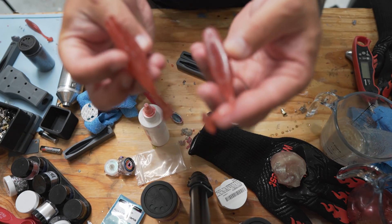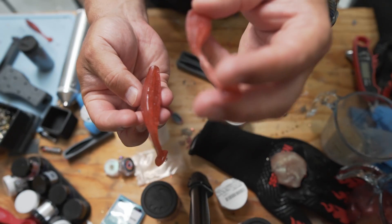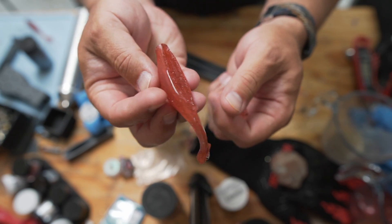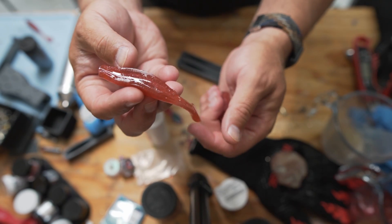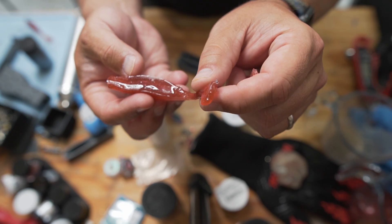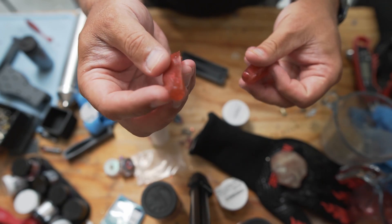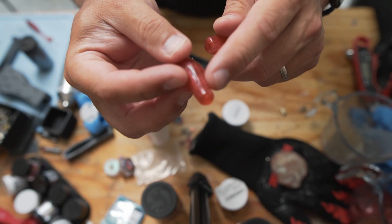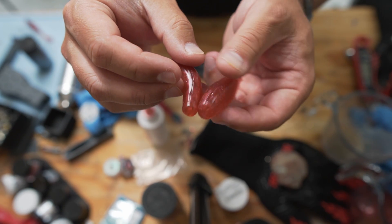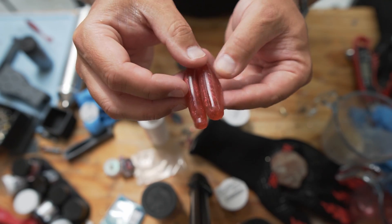Here's a comparison between the two versions. V1's tail is not as well formed and the tail section is a disaster. V2 is a little bit stiffer but still plenty flexible, and the tail is a little deeper and wider — hopefully providing a lot more action. On the front I basically extruded a 10mm circle to give a nicer spot to rig compared to V1.